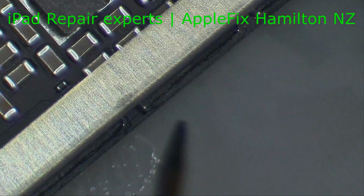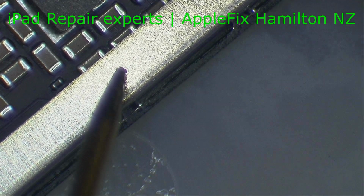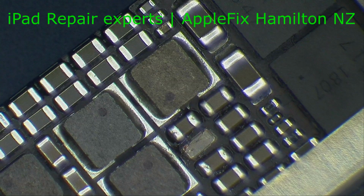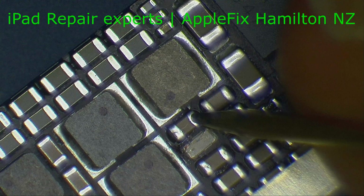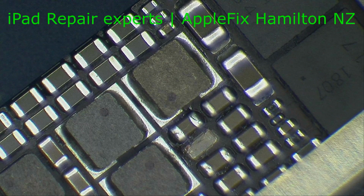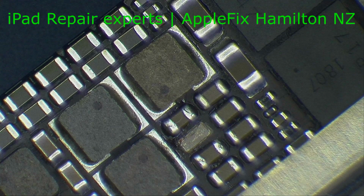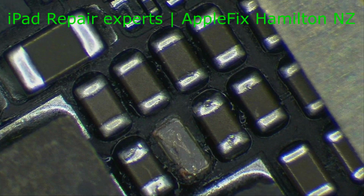Yep. Is this line shorted still? No, this is also shorted. It's still shorted. Oh, sorry, you can't see here. Even after removing this, see, still short. Very low resistance. Yep. This is all shorted. Okay. I think I have to remove what is left from that resistor and see how it goes. To me it looks like maybe there is more than one which is shorted.